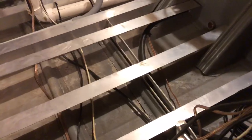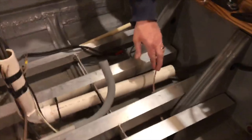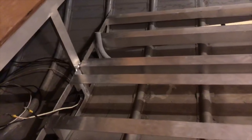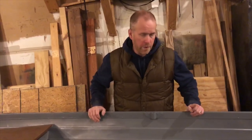That'll come up into the battery seat box conduit to make it easier if we need to change out the motor or do a repair — much easier to move in and out. Over in this far corner, there's obviously a whole big mess of wires — that's where the switches are all going to be, along with feeds for all the different lights. We also ran one extra feed over here if we decide we want to hook in a bilge pump, and we ran one extra feed up to the front for a live well or portable live well hookup, just to have another switch power. So that's it for now — rough-in wiring pretty well complete.